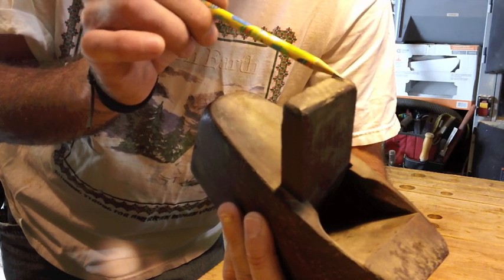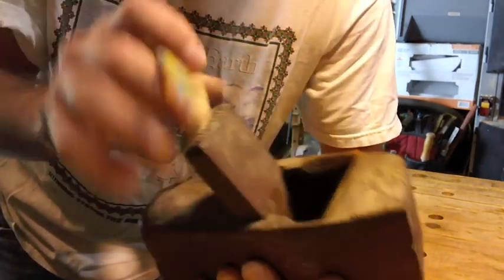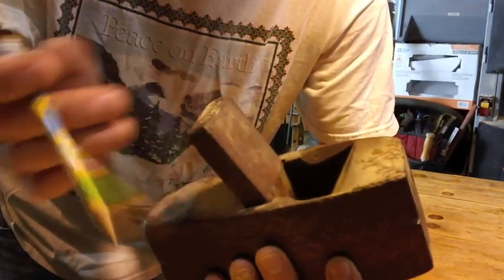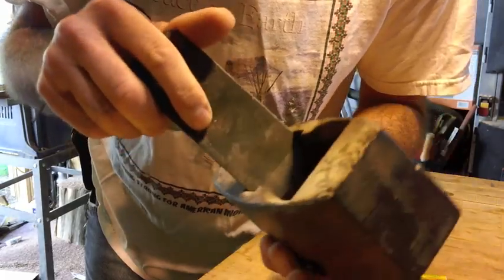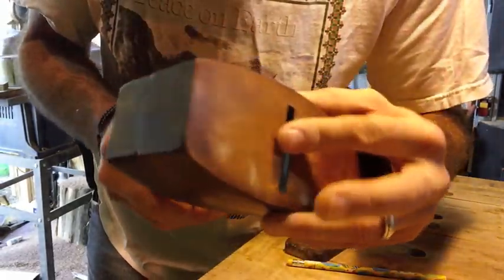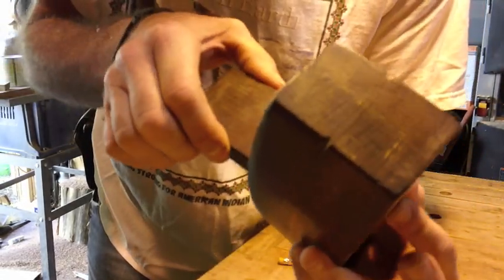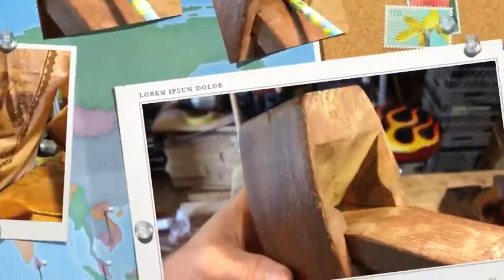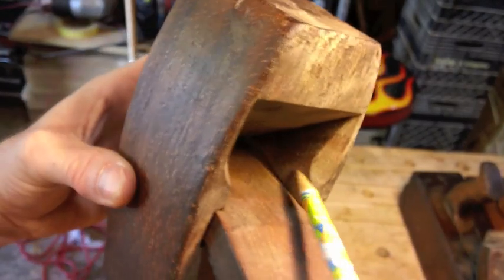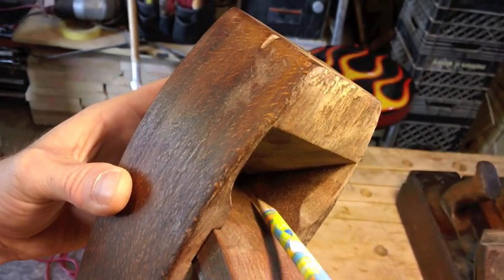This one's in pretty good shape. You want to look at the top of the wedge — most people will hit that with metal and it will just get shaved down to nothing and mushroomed out. You can clean it up or replace it. Apply the iron back into the plane, put your finger at the mouth, tighten it up, put the wedge in the plane and set it just a little bit to see where the top edge of the wedge meets the plane. You want that to be tight.